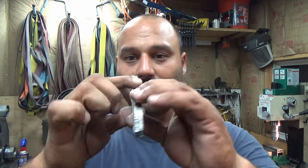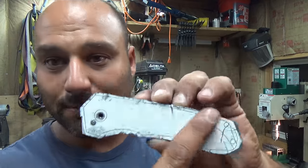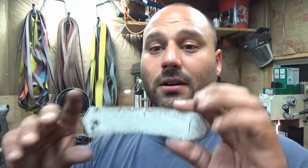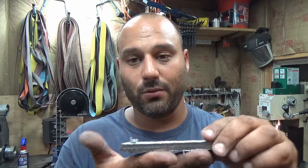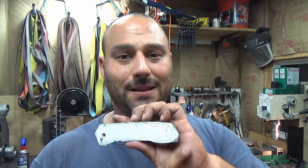Now as you can see, we have two pieces rough cut out. This is why you don't want to slide your template side around on a work rest — in this case the rest of the bandsaw. When we go to the grinder and profile these out, it's going to really beat up your template. So this is a good thing — we're going to slide around on this one on the work rest like this. We don't need this side anyway, so we're going to sacrifice it. Save our work rest. Save the titanium from getting some real deep gouges in it. That really helps a lot. If you don't have a template on it, throw a piece of tape or something to slide around on. It'll make your life so much easier.